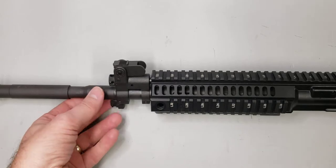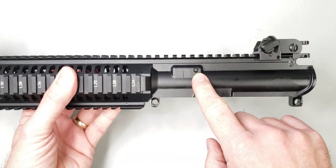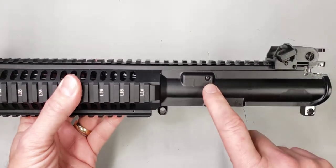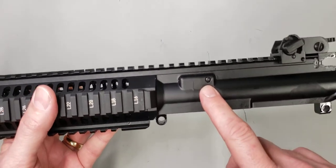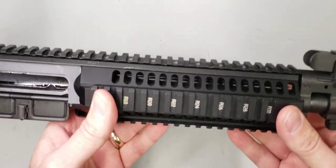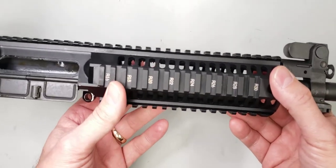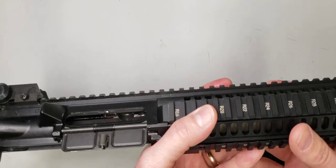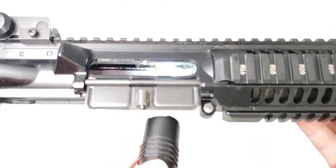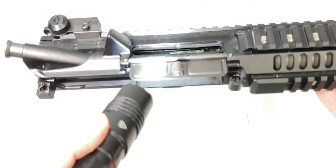What I'm going to talk about in the video today is this little screw right here. A common question I'm getting is: what is that screw for? Well, in short, this screw is a retainer for a reinforcement plate in the upper receiver. This reinforcement is a unique feature to Colt's monolithic or modular upper receivers, and that screw provides retention for that little steel plate.